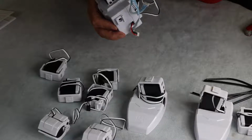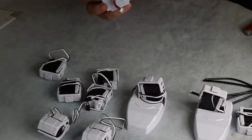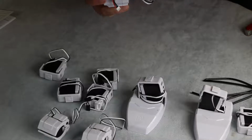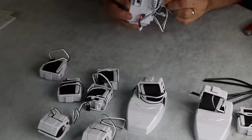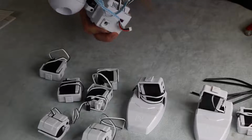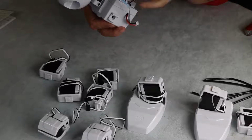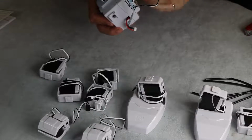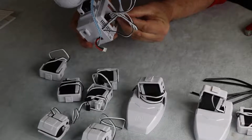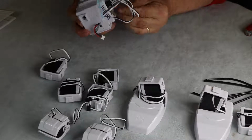This servo is inside the head, and it's controlling, you can see the servo base here moving. That's a horizontal, so the horizontal goes on to D0, which is the first of our connectors, and there we go. So we have 4 servos connected. We now have to connect the camera to the camera port. This is an easy one. There is only one camera port, and we need to mount it so that the tabs are at the top so it fits in nicely, and that is mounted there.